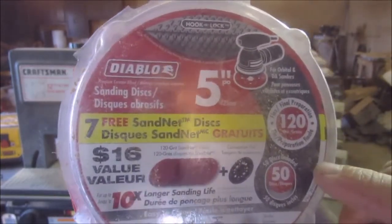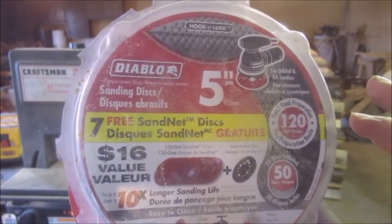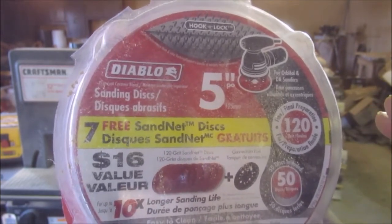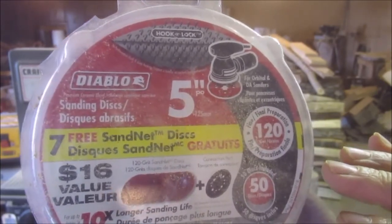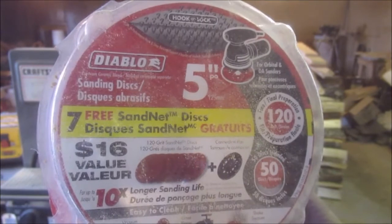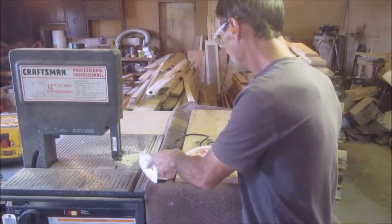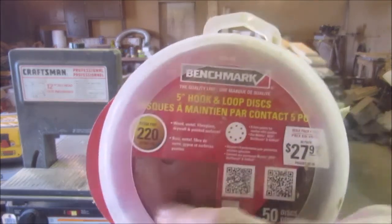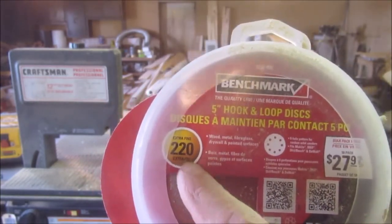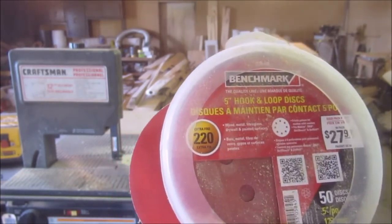When you're sanding, you should start like 80, 120, 180, then maybe 220. Some even go up to 320 for final passes. And cars actually go up to, oh, you can get sandpaper up to 1500, right? That's really fine. My final pass is going to be 220, extra fine. And the thing is, with the gloss, it really shows up, okay?